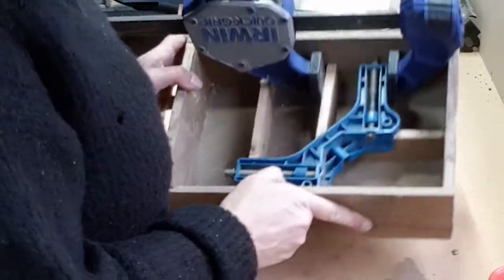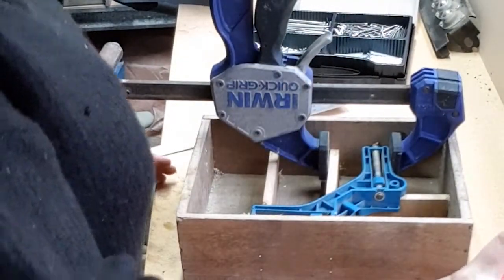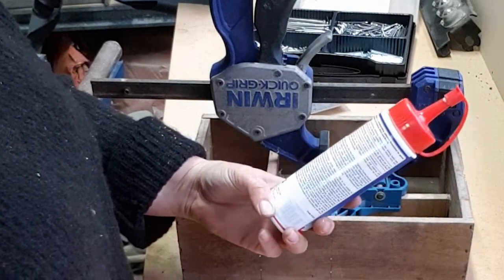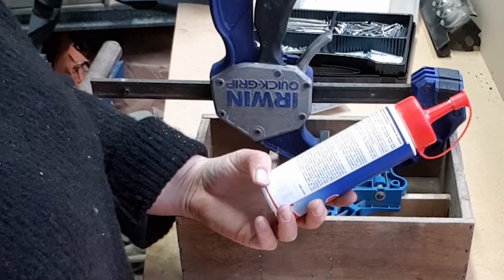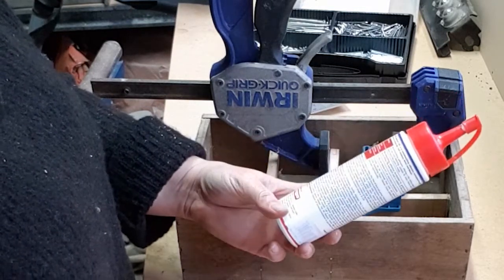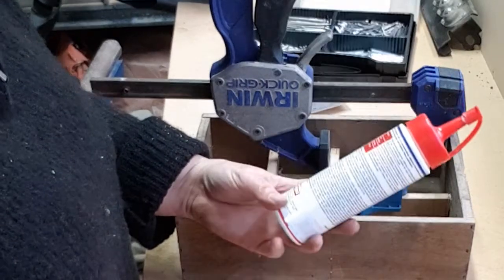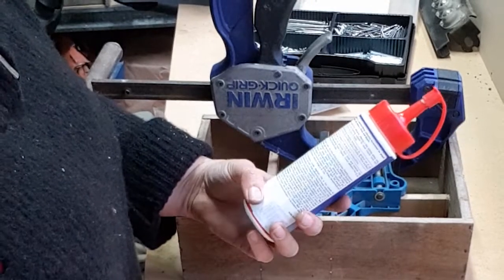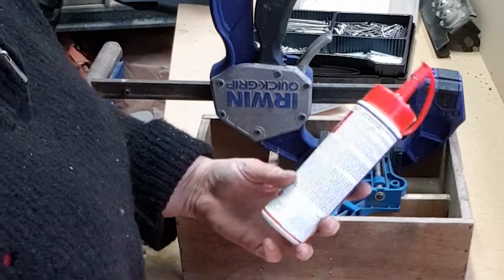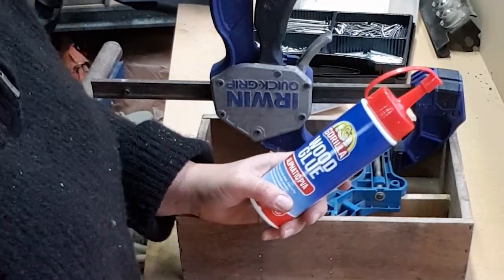All right, so I'm going to let that set up and come back. Now, this glue asks you to clamp for 3 to 4 hours and will reach maximum strength in 24 to 48 hours. So it's getting dark, it's getting late, and I'm going to my mother-in-law's for dinner. So I'll be back in the morning to finish this. See you soon.